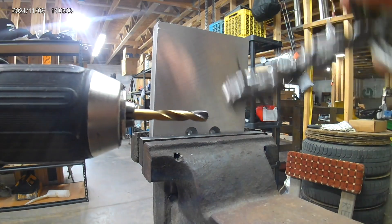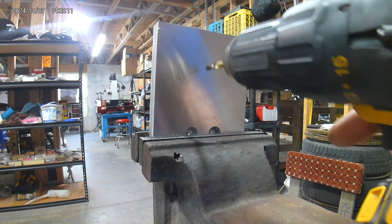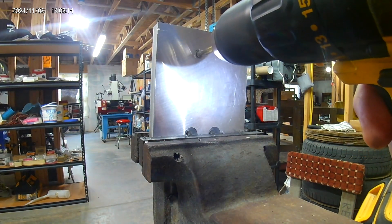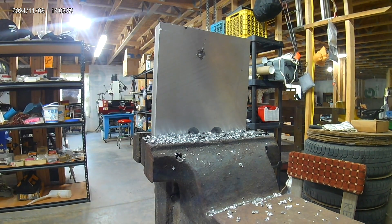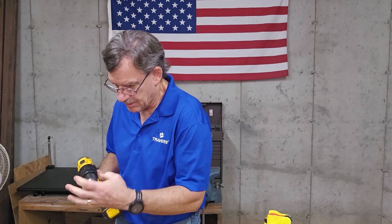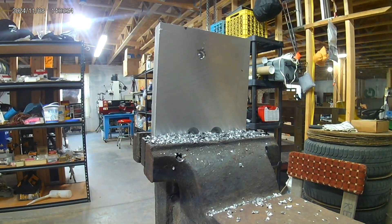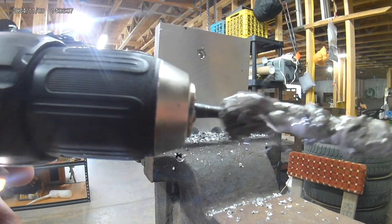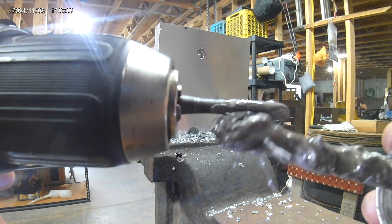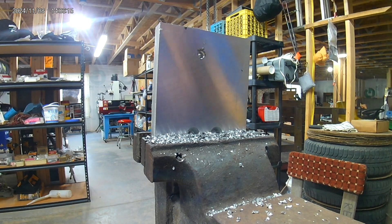Okay, so let's give it a try and see how well it works. I'm going to put a little bit of this on my drill — just coat it a little bit. That worked pretty well. Just going to give it a little bit of a chamfer. That's enough. Now I'm going to coat the tap with my homegrown makeshift tapping oil, and let's see how it works.